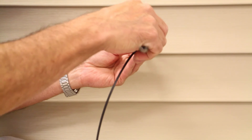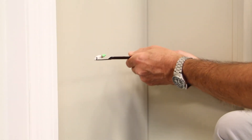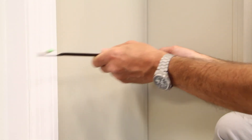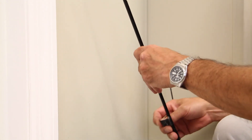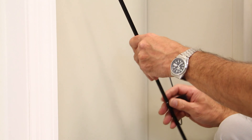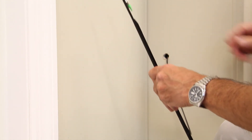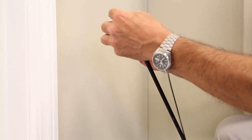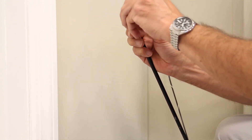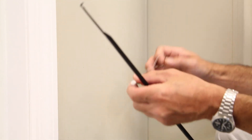Now insert through the wall — a half inch hole through the wall. From inside the dwelling, pull the fit tool completely through the wall. Remove the tape that you used to help secure the peelable micro drop cable to the fit tool. Pull the SC connector off the fit tool, reinstall your cap, and your peelable micro drop cable is now through the wall.